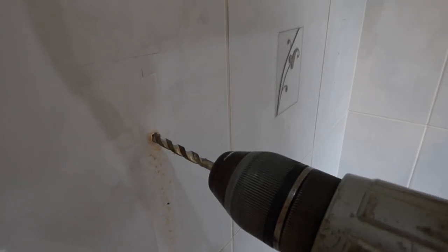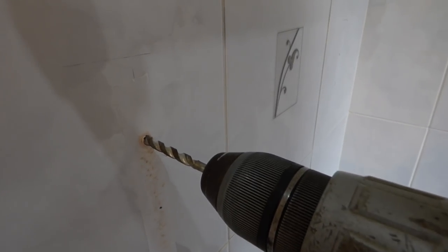And make a hole for your plasterboard fixers. If you stop and get through a little way and you hit wood, well that's fine — because you can screw straight into that. You don't need a plasterboard fixer. That's sheer luck if that happens. So let's just get this on hammer now — it'll make a lot more noise.